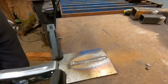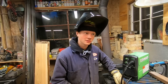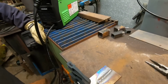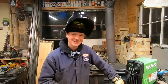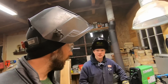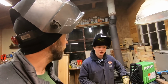I like it. This one, you actually had a little seam to put together two pieces. Did you find you could actually follow down the actual seam on there? Could you see it when you're welding? No. You couldn't see it? Usually I find it gives you something good as a little guideline, but anyways, that turned out really nice. I just saw the line and went straight. Just tried to follow it in memory. When I weld, I like to look in, actually when you have a good helmet, you can actually see what you're doing. I like to see the wire going in. I like to look at the puddle. You've been paying attention to the puddle and the buildup and everything like that? I can see that. Yeah, that's good.